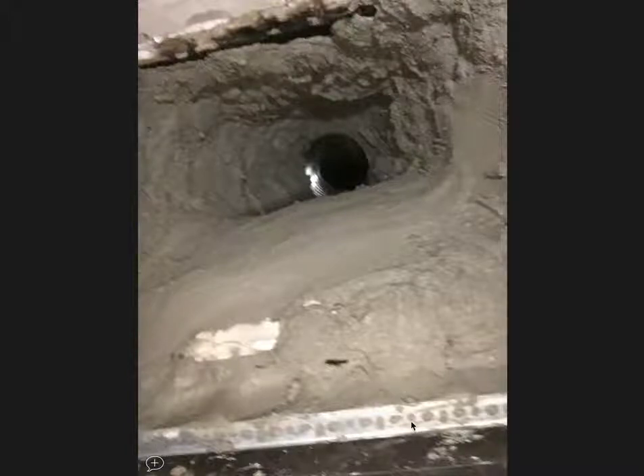At the lintel, this is looking up through the opening, so this bar here is the steel lintel at the front of the fireplace. Then we add a steel support beam behind that lintel to hold an inch and a half thick of parge coat, which is Chamber Tech.